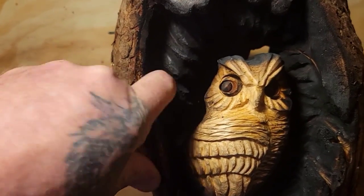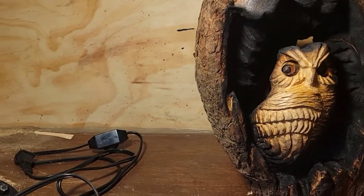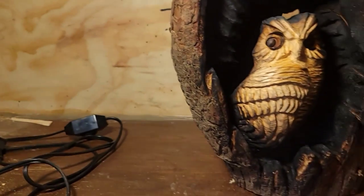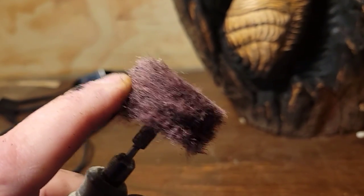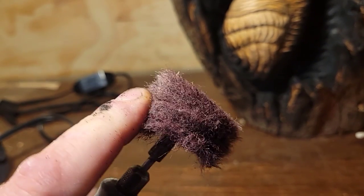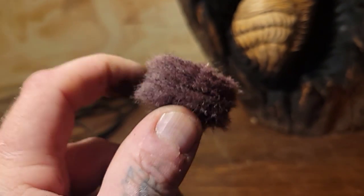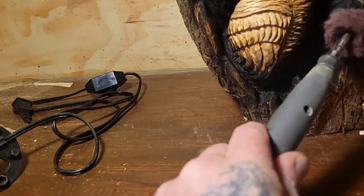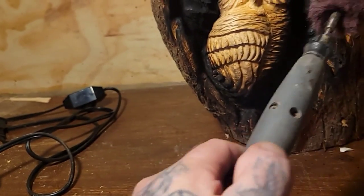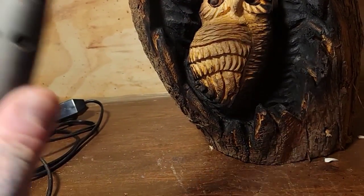You can see here that I burnt all this char in here — it's all burnt, it's sturdy. Some of it where I sprayed with clear coat, the char is locked in so you can't really rub anything off. I want to clean up around the outside a bit more. I've got a Peter Blair sanding mandrel with Scotch Brite — this is stuff you use for automotive or dishes. You can get the green stuff at the dollar store, but it doesn't last as long. I'd suggest going to the automotive shop and getting automotive-grade stuff. I just cut it up in little squares — there's five pieces on here and I screwed them on. You've got to turn your Dremel down when you do this because it will fry your Dremel using this or sandpaper. Turn it down to half speed. Don't be a Jordy.